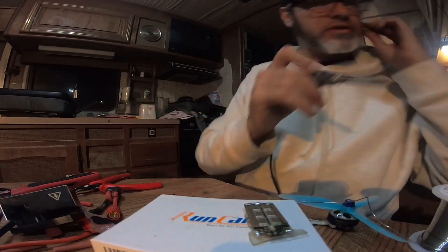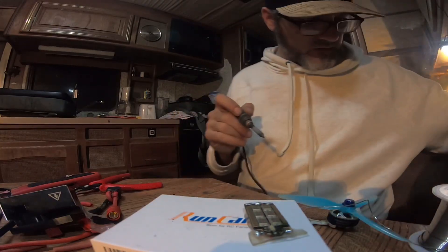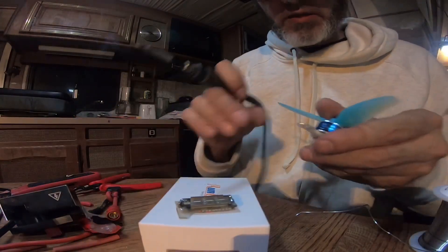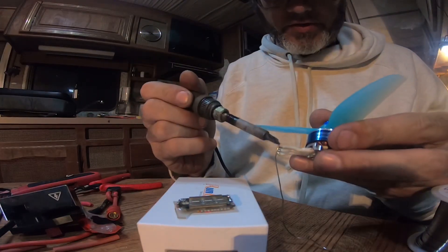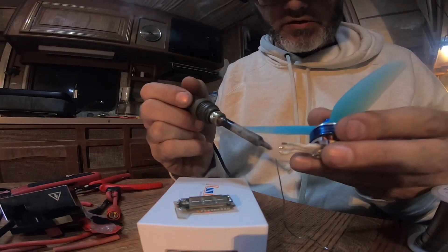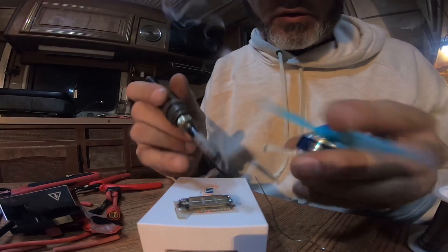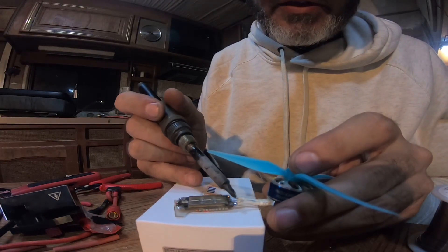All right, so that's prepped again to wire to solder to. We got some wires running — we'll just solder right back on what we had. Let's start with the motor. Same deal — I want to make sure all my solder points are fresh on here. A little fresh solder — I like to just shake it off onto my table and clean it off later. Just touch it till it gets a nice flow.